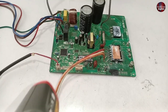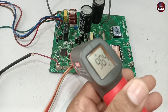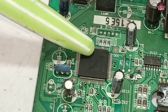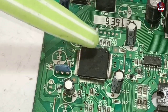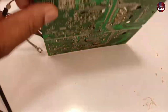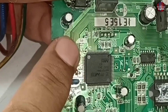The motherboard has also turned on, and I will check its temperature. Still, the temperature is high in the top corner of the microcontroller, while the bottom corner has a lower temperature. As the top corner of the microcontroller is heating up more than the bottom, I will focus more on the capacitors installed on the top side of the microcontroller. I have checked the components on the back side and front side of the motherboard off-camera to prevent this video from getting too long, and especially I checked the capacitors installed on the top side.